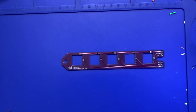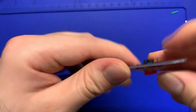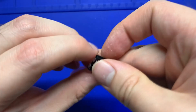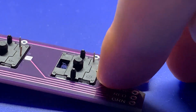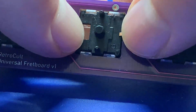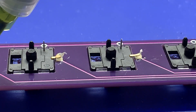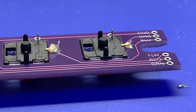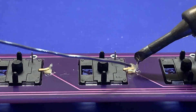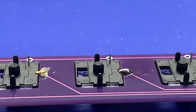Next step is putting together the fretboard. Grab the fretboard and the switches, and slide them right into place — just push them right in. Use the surface to push them down and slot them into place. Then bend the pins over to the pads as close as you can. Don't worry if they're not touching exactly — we'll take care of that in the soldering step. Flux up all the pads and flood them pretty heavily with solder to make a nice solid connection. Don't hold the soldering iron there too long, otherwise you might melt the plastic on the bottom of the switch.